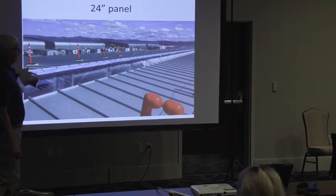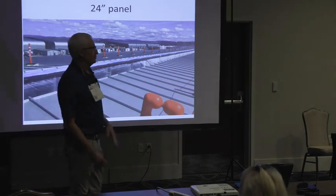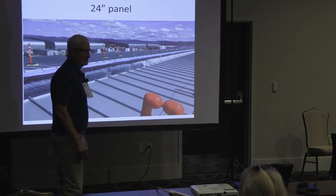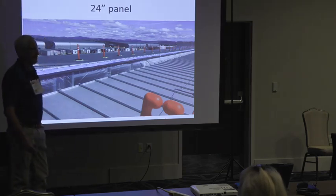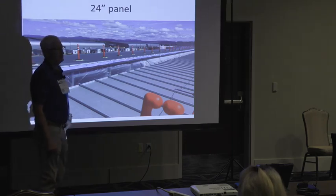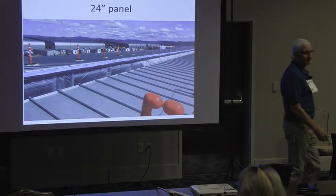But it was a 16-inch panel, and then the second building got built behind it, and it had this 16-inch panel specified. You know, this one is going to be the not so pretty building. The first one was where I saw nobody seeing this, so they took the curve off and they just wanted straight run panels. So I knew that they were going to look for some money. I switched into a 24-inch wide panel from that 16-inch panel. It was a $750,000 saving on 360,000 square feet. So it was about, you know, $2 a square foot.